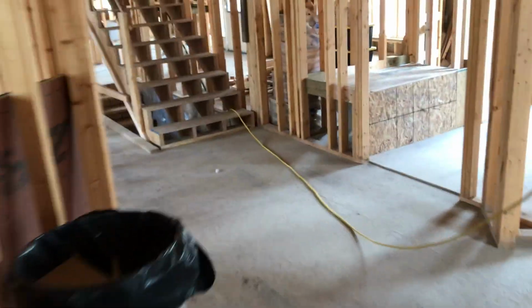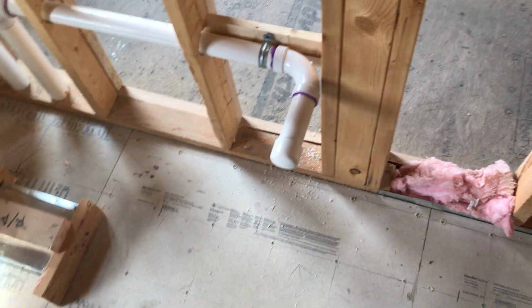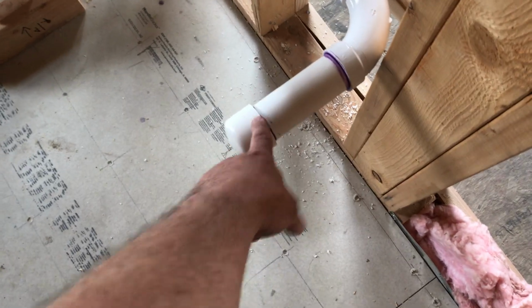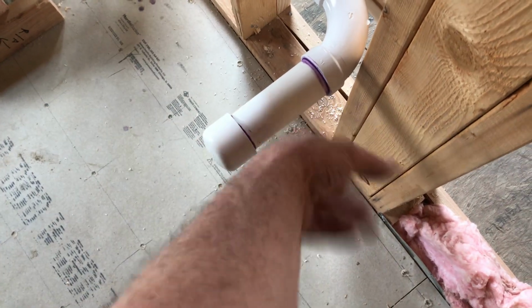So then here, what do we got here? We've got just glued on a cap. I just got the cheapest caps you can get, really. It's just like a couple dollars for nice PVC. Once you get drywalled and this gets water tested, drain all the water out from that rubber cap outside, and then just cut this back whenever you're gonna glue on your adapter for your P-trap.